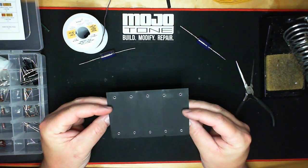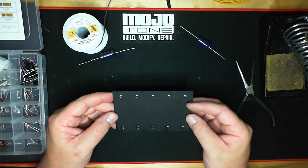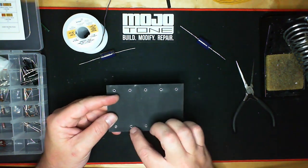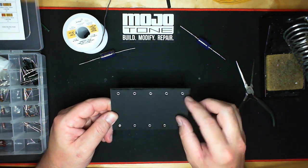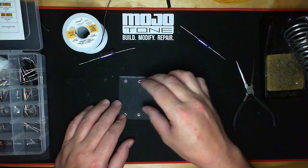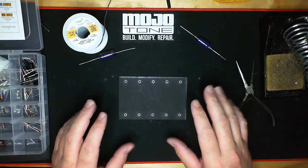For fiber boards there is a top and a bottom — you can tell just by looking. Usually when we laser them, they're always lasered from the top, and on the bottom you can see the blow-through or where it sat on the grate. We put the eyelets through one particular direction: the flange sits on top and the crimp sits on the bottom. The crimp is almost always smaller in diameter than the actual flange on top — that's a really good way to tell what the top and bottom is. We always insert from the top, unless you're working on an amp's main fiber board which does have traces coming up through the bottom.